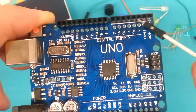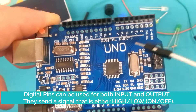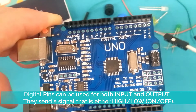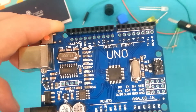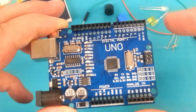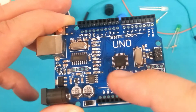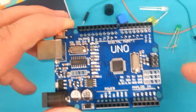The digital input-output pins, as indicated by the name, can receive information from accessories and can also be used to send information to another device such as an LED, a display screen, or a motor — anything like that. This is what the microcontroller is really good at doing: taking information from the outside world, processing it with the program that you wrote for it, and then telling other things what to do.